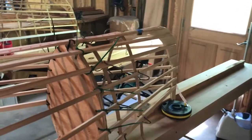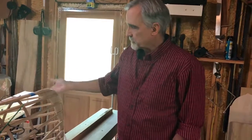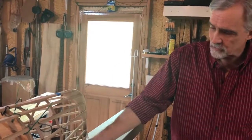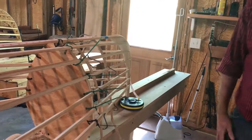That's how you put on ribs. One important tip: put your ribs on in two batches. Don't put all your ribs in the steamer at once, because by the time you get to the last ones they'd have been steaming for an hour to an hour and a half — longer than needed. These have been steaming for about 25 minutes and are perfectly flexible, work very well, and are still tough enough not to split. That's steaming and installing ribs.